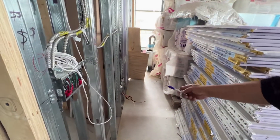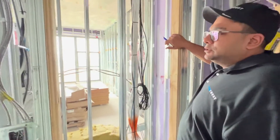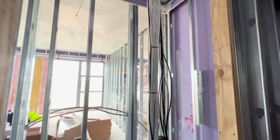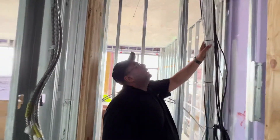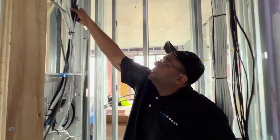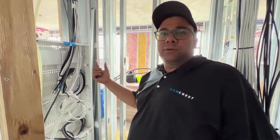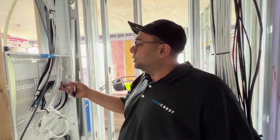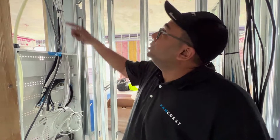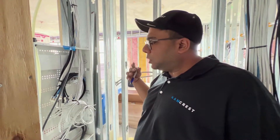So coax and Ethernet in the living room — really all four corners of the living room have coax and Ethernet, three corners on the front left and right, not the rear. This is basically your closet — this is where all the home runs are coming in. As you can see, we came out of this cavity and over here. Minus these wires, just this bundle right here — this is what the existing wiring was in the apartment. We pretty much reused these wires. Majority of the receptacle boxes you see on the perimeter of the rooms use this wiring. We ran a jump connection to our side so we can take this entire box and jump it as needed to our wiring on top.